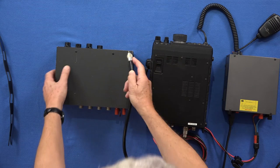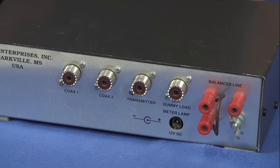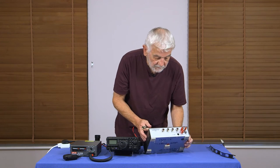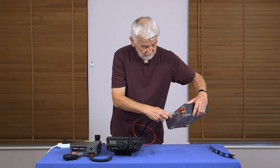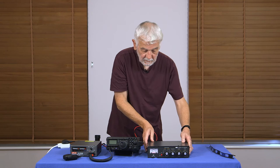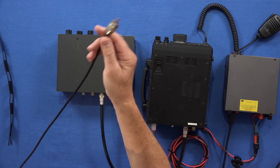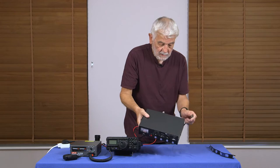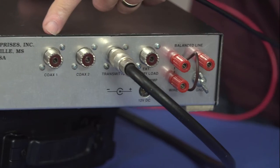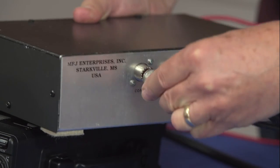On the end of the plug are small detents — little triangular pieces. These need to locate into the serrations or crown of the socket so that when you tighten it, it all goes up firmly and doesn't rotate. The feed from the transceiver then connects into the back of the AMU. You'll notice the back of the AMU has a number of sockets variously labelled — we need the one marked 'transmitter' to connect the AMU to the transceiver. The aerial feed in this case is coaxial and goes into the socket marked 'coax one'. Again, just make sure the plug is seated and lightly screw it up until it's firm.